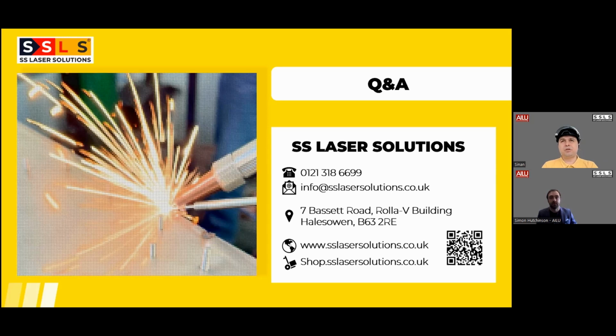But we use, for example, in our showroom, pure argon. The supplier is your choice, we use BOC, but you can also use nitrogen. But the gas has to be pure because we need an inert gas. Inert means it shouldn't be getting into a chemical reaction with the material. So that's why it is a shield gas. If it is getting into a chemical reaction, that will negatively affect your weld quality.